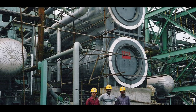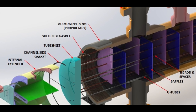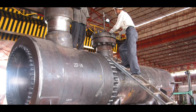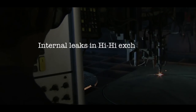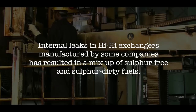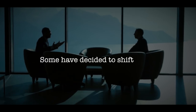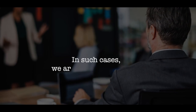High-high is environmentally safer as the main joint between the shell side and tube side is internal, and any leakage does not escape to the atmosphere. In the high-low construction, there is a possibility of leakage causing a potentially hazardous condition. Internal leaks in high-high exchangers manufactured by some companies have resulted in a mix-up of sulfur-free and sulfur-dirty fuels. End users and technology providers are in two minds; some have decided to shift from high-high to high-low even with high pressure on the shell side.